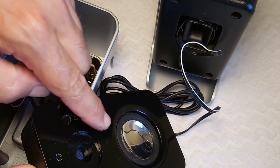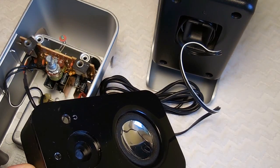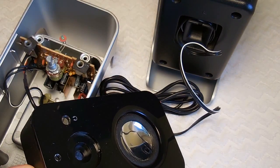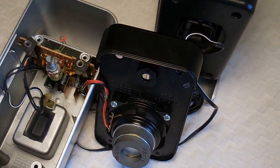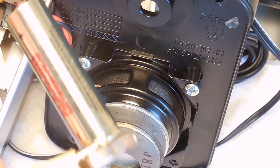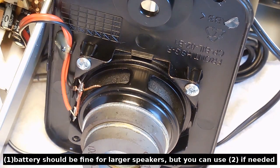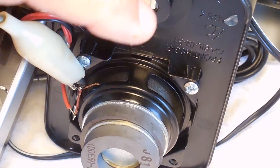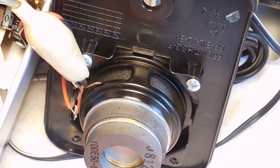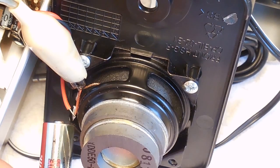What you're going to do is take a battery connected to the wires on the speaker. When you notice that the cone pushes out, wherever the battery positive is on the wire going to the speaker — that is the positive for the speaker. Let me give you a quick demo. I have a neodymium speaker connected to a double-A battery. I'm going to take this and connect this to the negative right here, and then touch the positive to the positive.